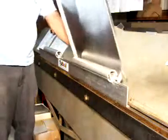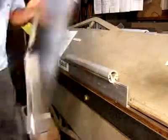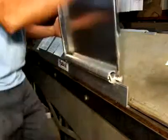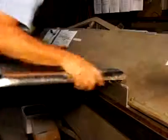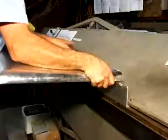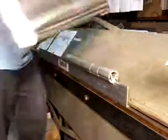Hard like that. Check the angle. If it's too much, pull back. Now we're going to take off the 10 and the 15 over. Do the other 2 bends. All pulled by hand. Pull the corners open. Past. Pull back. Slide it out. Around. Same thing. Too much, come back in and pull back.